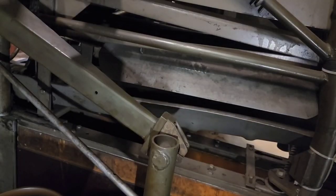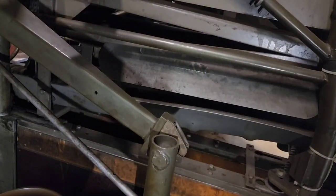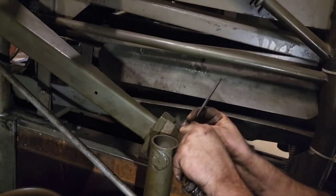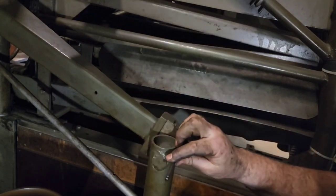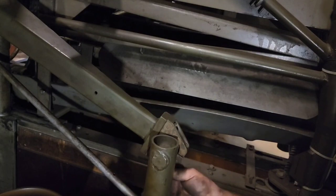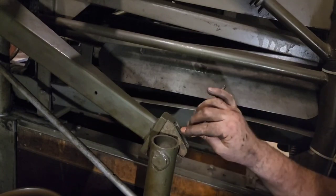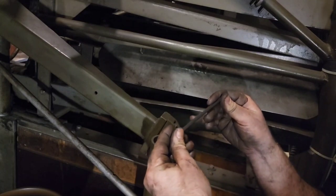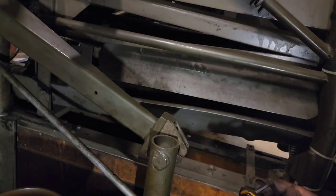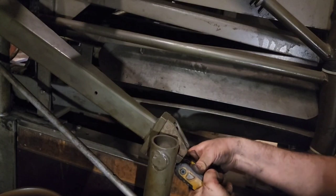I've swung you guys around to the 10-pin side. We're going to remove the two screws on this bearing cap. I'm hopeful that the deck shaft isn't going to shift too much. Different size bolt head in there - weird. What is this one? 7/32nds. And the bottom screw is quarter inch - yep, oversized, weird.